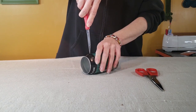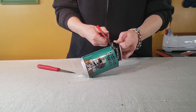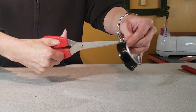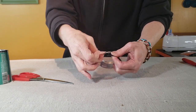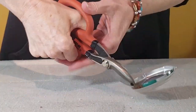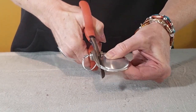Once I have the lid removed, I'm going to cut off the top part of the can using a regular paring knife. Once I have a big enough portion cut, I trim the rest with my scissors and then cut the walls of the can and the bottom of the can off. Next I want to get down to the ring at the top lip of the can by cutting some slits in the remaining metal and bending the tabs back and forth to remove them. To prepare the bottom of the can, I use my tin snips to cut off the excess metal and trim down the edge to leave just the domed portion.